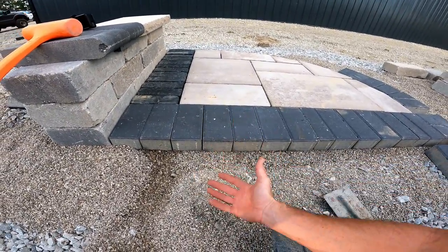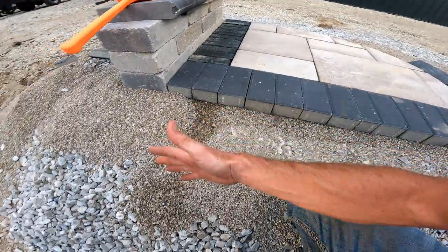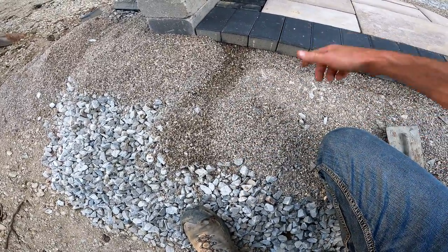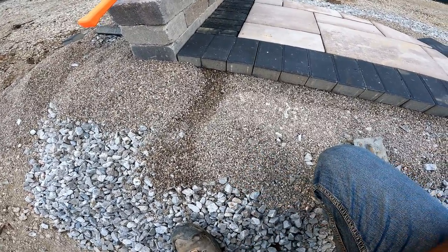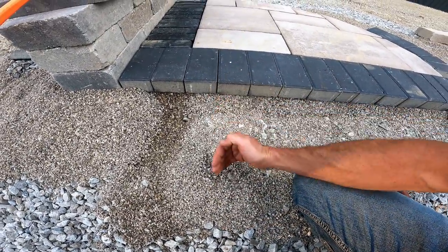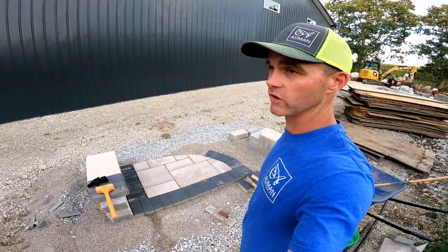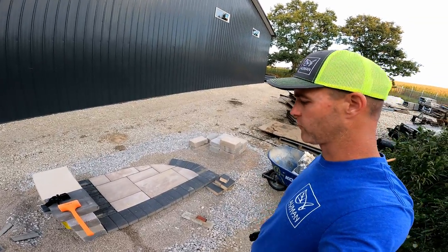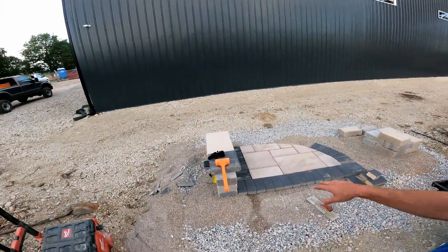You can use a company called Pave Tool, which has an aluminum edge restraint with a special wedge-shaped spike that grabs into open graded stone. A round spike will not grab in this — the spike just rips through laterally. We've tried the Pave Tool edge; it's not a product we're a super fan of, though nothing personal — they are hardscape authorities and I trust what they put out.